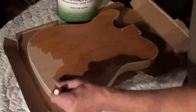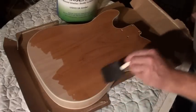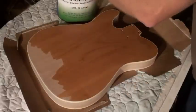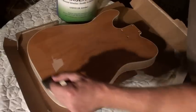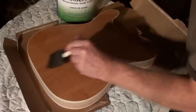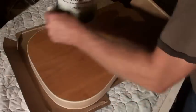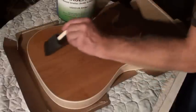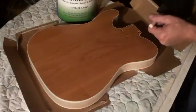What's really nice about this water-based stuff is it hardly smells and the cleanup is just warm soapy water, no heavy chemicals. And of course because of issues with solvent-based finishes getting across the border, some of the product you may want to get you can't get. The other thing I've done to prep this body is before starting the shellac I hit it with water just to let the grain raise, then sanded it back down with 320, and that definitely helps.